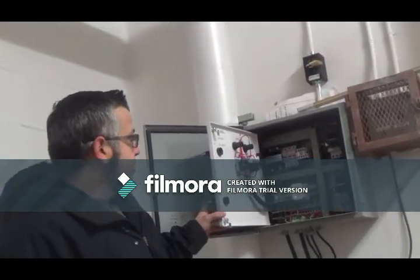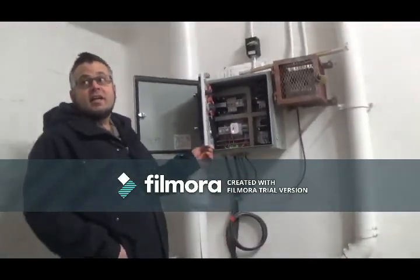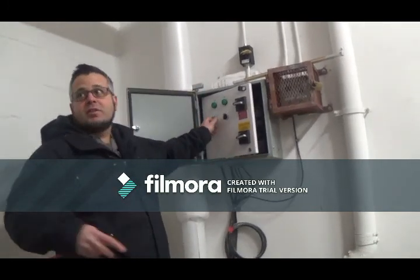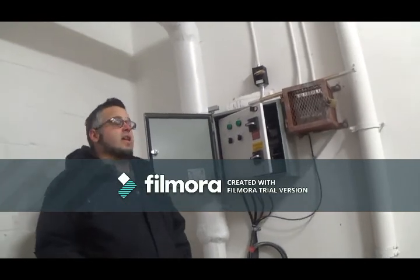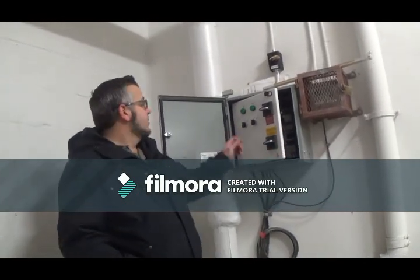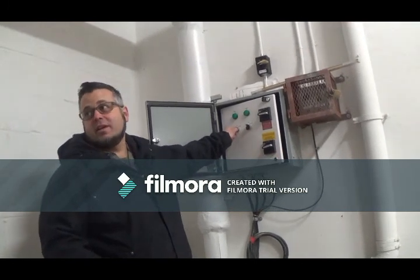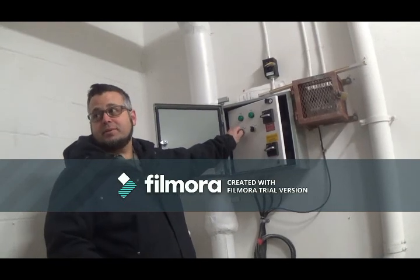And that's pretty much straightforward. So, would it be possible to overheat the pump? Overheat? Yeah, if you're running dry. If you leave it on hand and walk away, the pump will just run until it burns out. I don't know exactly how long, but this is only for servicing the pump. So never turn it on hand and walk away. Always keep an eye on the water level to make sure it doesn't go below the pump.